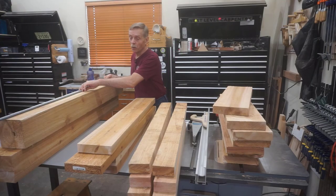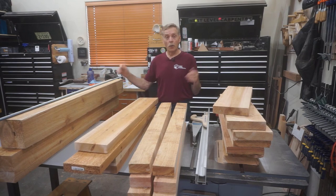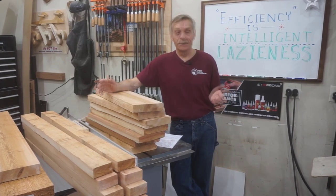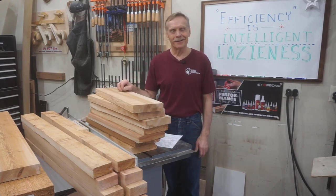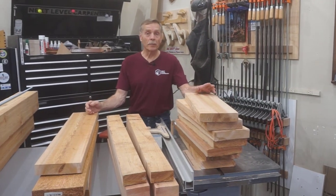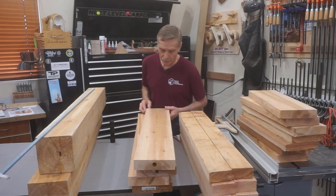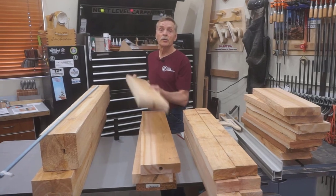That decision made drilling holes over 3 feet long through cross members like this the crux of the whole bunk bed build. And this is a situation that I often run into on these custom design build projects, where I do the design first and then figure out a plan to take the design from concept to reality second. And this is the kind of challenge that I like best, because brainstorming through a problem like this and reaching an elegant solution is a highly rewarding experience. Plus also, now I can show you how I drilled perfect 3/4 inch diameter holes through these 3 foot long pieces of rough sawn cedar 2x8.